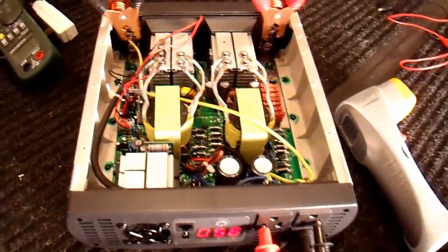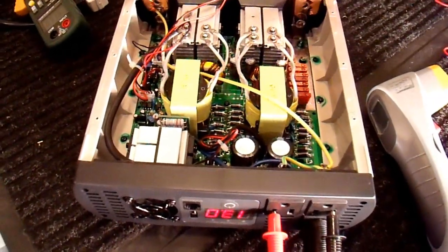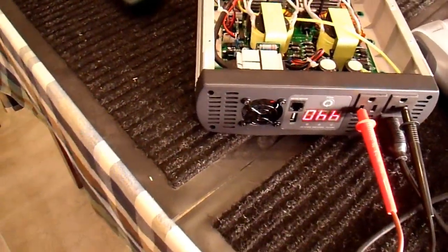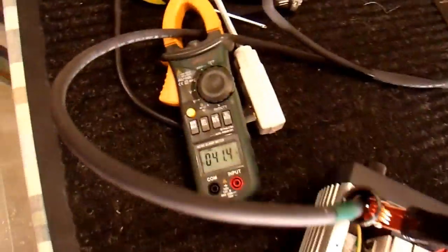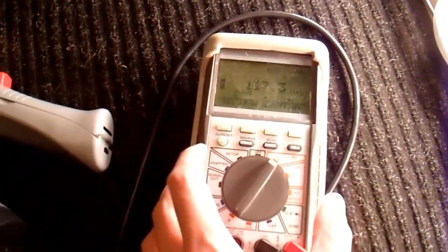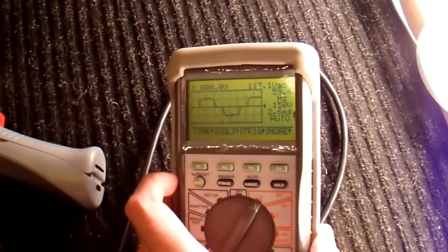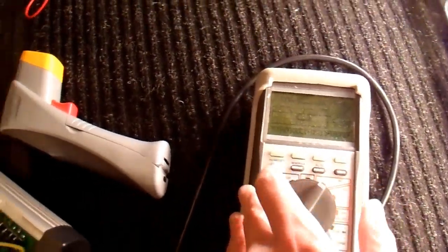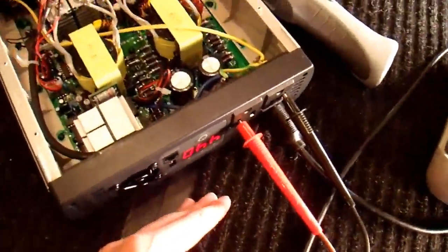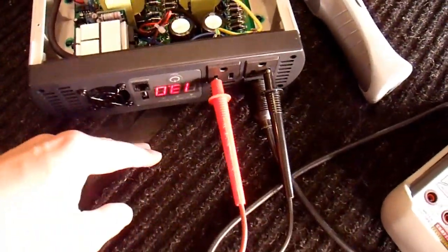Turning on another light bulb — the fan speeds up. One more. Now we're drawing 41 amps. I can't go a lot more on this power supply or it will overload. So I'm going to keep it here for a little while and see how the inverter does. We're at the correct voltage and our waveform looks like a standard modified sine. So that's good. I'm going to monitor it like this for a while and see if anything gets warm — hopefully those fans work.